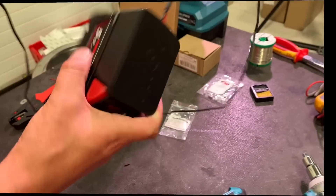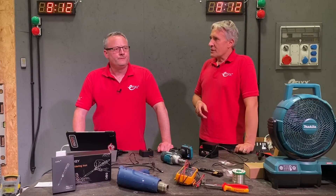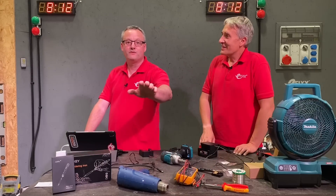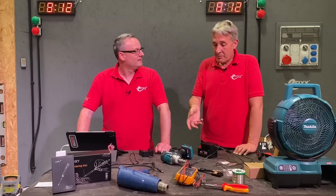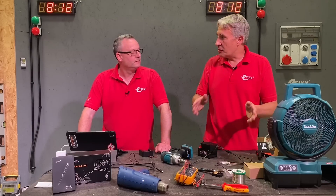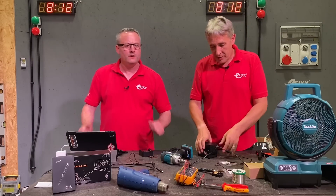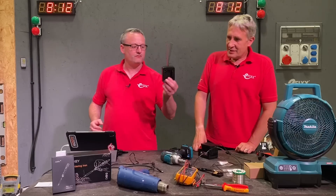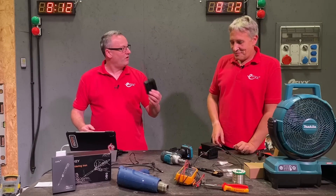And that's how we use it. You know, if you're doing a lot of LED strip on site — something he likes to call 'lead tape' — you can get a battery soldering iron. You can get a gas soldering iron too, and people say Milwaukee do one, but by being battery-powered it's going to be heavy. We like this iron; ideal for lead tape, delicate work, getting in close when you've got those pads close together. Price-wise, give me a ballpark — I think it was about ten pounds. So I've actually made a battery soldering iron for a tenner.